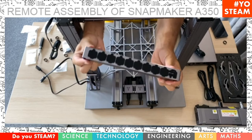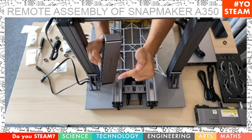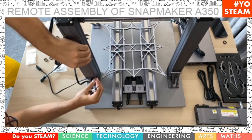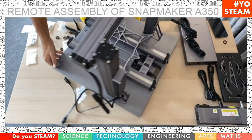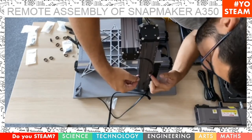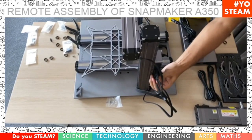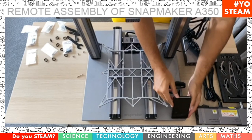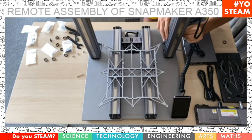Now attach the controller over the right Z axis, making sure the sockets are looking outwards with the USB and power socket at the bottom. You will be using the size thirty screws. Now we are ready to plug our first cables — the Z axis, the Y, and the X. Open the protective dust plugs only for those and ensure the connection is safe. Turn around and place the touch screen — it's magnetic. Connect the cable to the controller where it reads 'screen'; it's a USB type C.